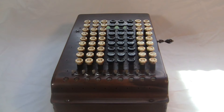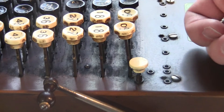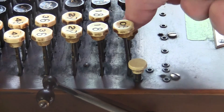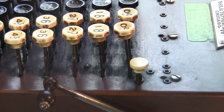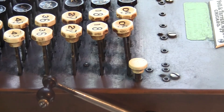Here's where the controlled key mechanism comes in. On the Comptometer, whenever a key doesn't press all the way down, the whole machine jams — all the buttons lock up and you can't do anything. The control key button clears this kind of jam and lets you keep on adding. You can actually see the button pop up when the jam happens. If you're lucky, you'll remember what you were doing at the moment of the jam and be able to resume your calculation without clearing and starting over.